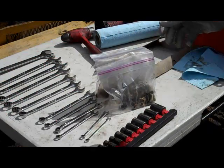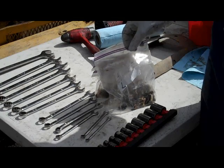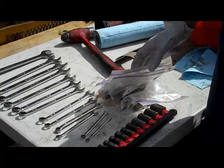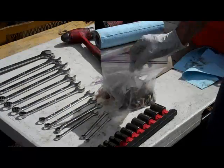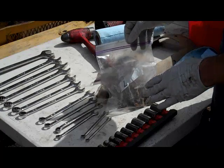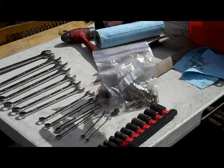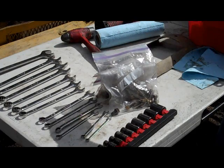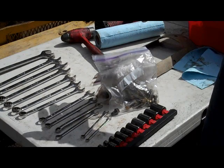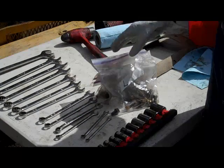Another thing to do when you're taking something apart — especially something as detailed as this — is to letter everything starting with A. When you're taking apart an individual part, take all the bolts and put them in a zip-lock bag and label it A, then the next part B, the next part C, and so on. When you go to put it back together, you can match up the corresponding letters. So this is letter L, and the part these bolts and fasteners came from also has the letter L. That way you can grab the bag and know you have everything you need. It also helps you put things back in the correct order. If you go A through Z, when you start reassembly you go in reverse order — grab the Z bag and work backwards — so you don't inadvertently get out of sequence and have to remove something because you didn't remember the correct order.